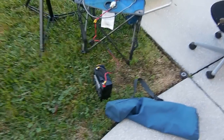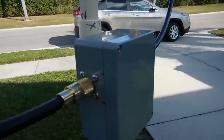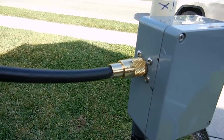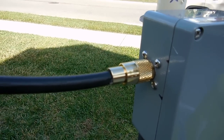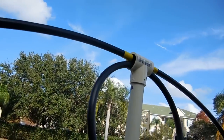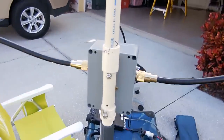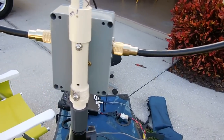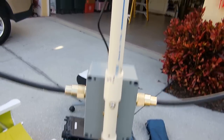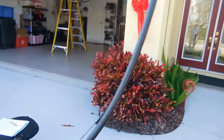I wanted to show this to you — I'm pretty happy about it. That's the capacitor box. I'm using just the shield of the coax; the center conductor is not connected. I'm using CPVC for the support, sitting on a buddy pole stand that I use, but I won't be taking that with me. I'll strip off some of this stuff for the hike and make it more lightweight — I've got some ideas to lighten it up. This is just the setup for the experiment.